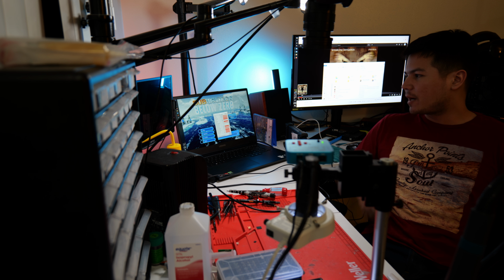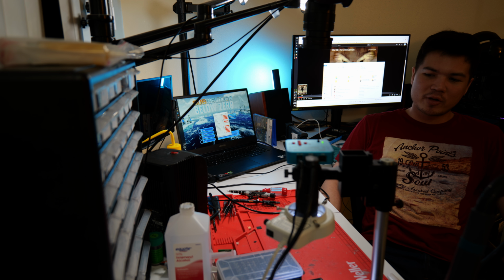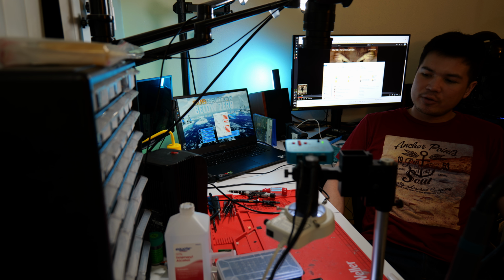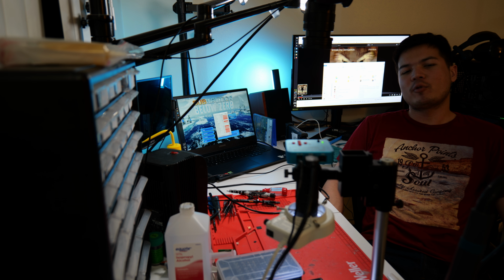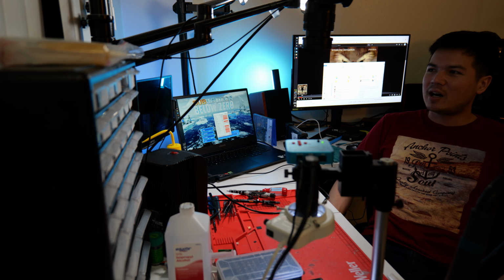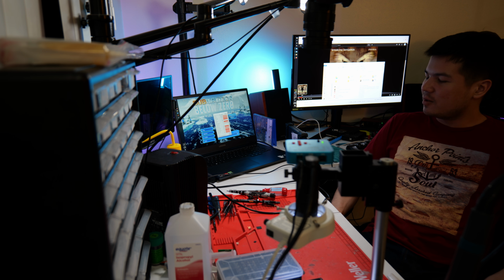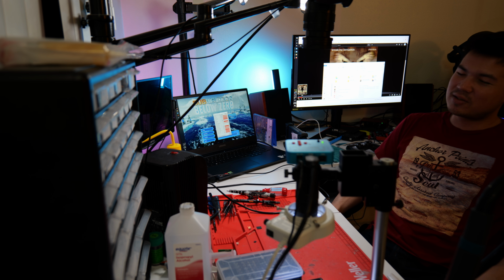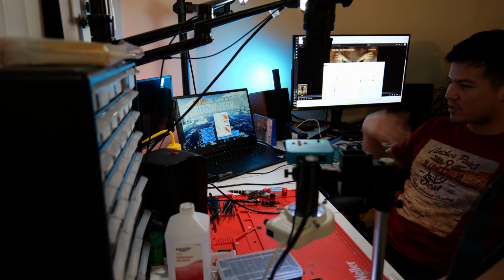Okay, as you can see, the laptop now works. If you're wondering, it's been under load for about 8 hours, not 8 hours straight, just 8 hours in total. This session has been about 2 hours long. So anyways, as you also saw, we had a dead capacitor, we had a dead power stage, and we also had a board layer short. I would say the short was about 4 layers deep, maybe 3, and not very wide, thankfully. It could have gone a lot worse. Most times when a power stage dies and catches fire, the crater it leaves is typically much bigger and much more problematic, but thankfully not in this case.